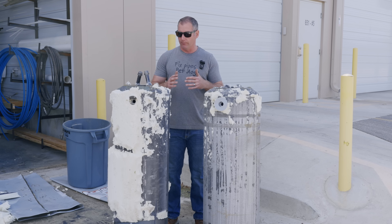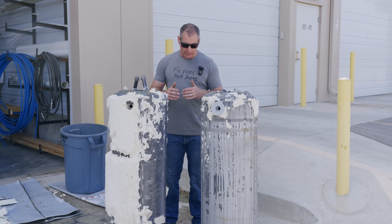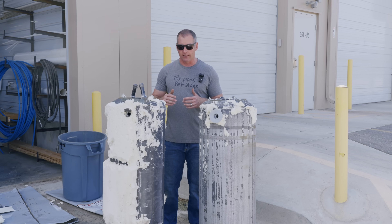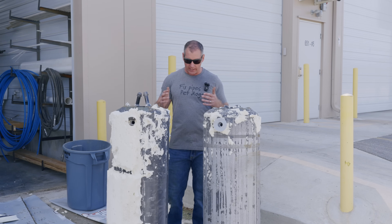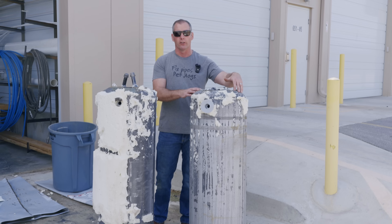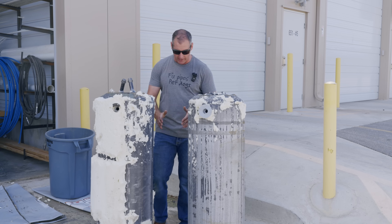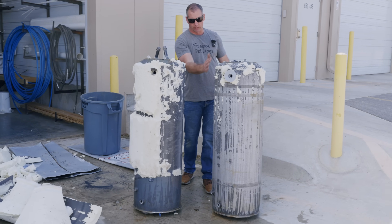They're supposed to trip the pressure relief valve at 150 PSI — we had nearly three times that in there, well outside design capacity. Hopefully you can see how straight the pro-grade unit remained versus how curved the box store tank became. The tanks are rated for about 300 PSI; the temperature-pressure relief valves would start dumping at 150 PSI. This pressure test demonstrated the structural difference between the two tanks clearly.